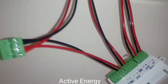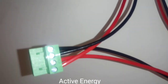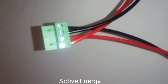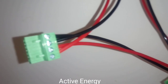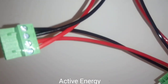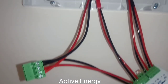Terminal 11 is the common — we call it 'comune' in Italian. Terminal 12 is the normally closed contact and terminal 13 is the normally open contact. The fire alarm terminal is indicated as the cable labeled 24/1. The red wire of 24/1 is connected to terminal 9.